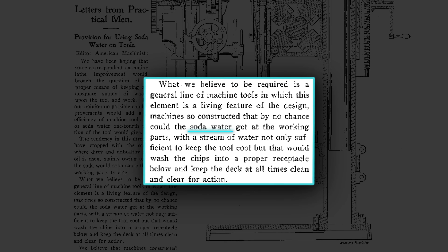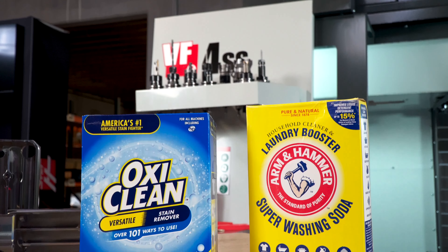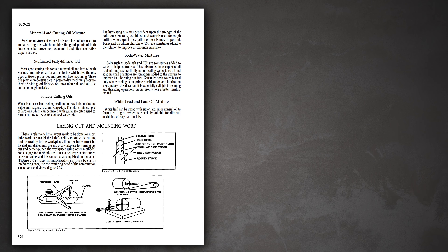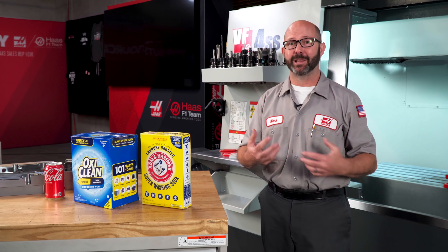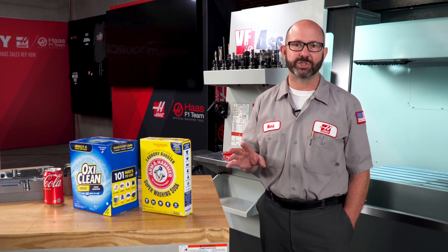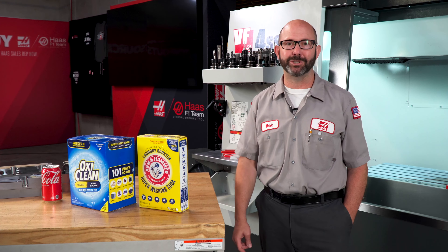If you were reading along with us earlier in that American Machinist article, you saw that in 1899, they were using soda water as coolant. That was not soda soda, but soda ash — which would keep the water from rusting their machines. We would know soda ash today as washing soda, or sodium carbonate, the main ingredient in some stain removers. Machinists would use soda water to cool their tools, which in 1899 were made of high carbon steel that would wear out fast from overheating. They didn't even have high speed steel yet in 1899, let alone the materials, carbides, and coatings that we use today. We mention all of this just to serve as a reminder that we are part of a long tradition of innovation and craftsmanship. Be proud of what you do. And we'll see you next time.